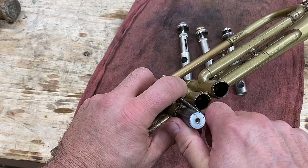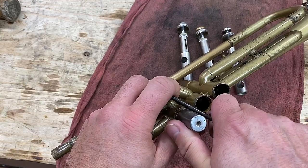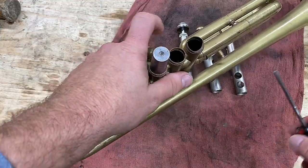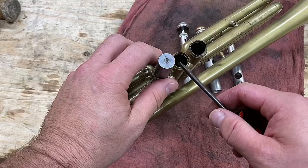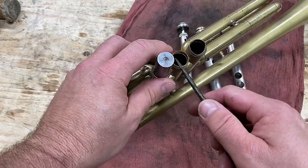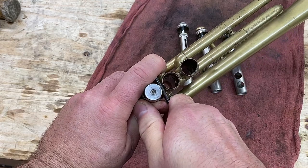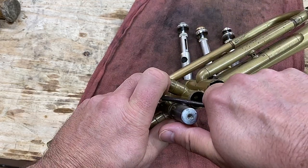The deal is to re-establish a lead thread for the cap to go on to. These have been expanded and pushed away, so I like this thick ridge of this screwdriver — it's a very wide blade. I like to use it to get in between the casings, and I just kind of roll that back and work it down against the steel.